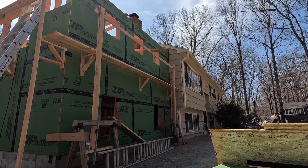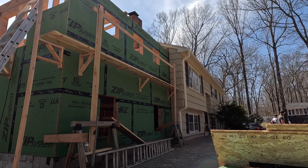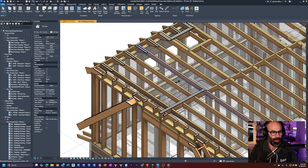When it comes to material loading, another thing we thought about was roof sheathing. What we were doing — and I don't think I had a video of it — is we were actually bringing the roof sheathing up to the floor level before we even built the exterior walls completely, then from there we brought them up to the ceiling joists, and then we plan on bringing them up to the roof rafters. Something to think about as you're going through a project — loading materials as a one or two man crew versus four or five, and whether there's a way to make that more efficient even at the design stage.